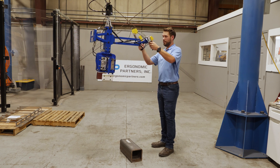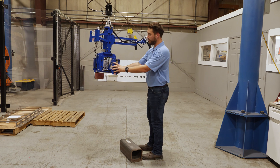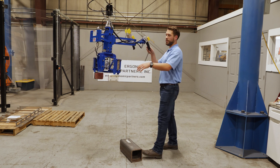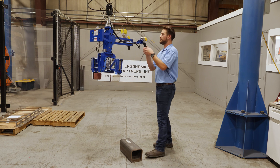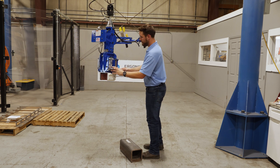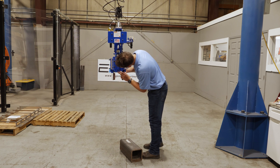To accommodate that wide variety in width, we offered them adjustable grip jaws. Here, that's one of the preset settings. To remove this detent pin to allow them to get in tighter, you want to make sure your jaws are all the way out, because we have additional locking jaws in here to keep that detent pin in place. I'll bring it all the way down to the interior spread and pop this pin back through.